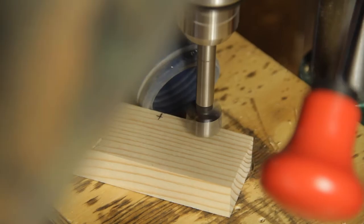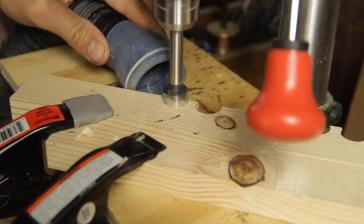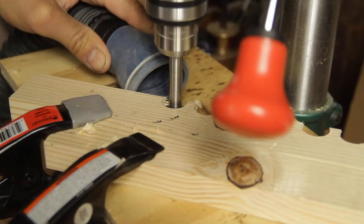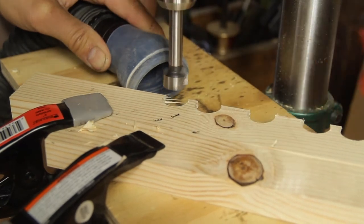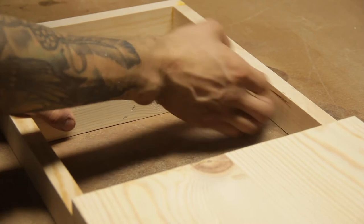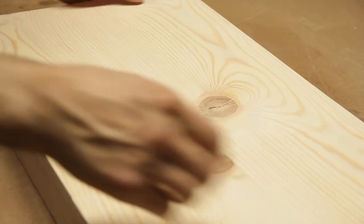While I was drilling, I realized my workpiece was still getting pushed away from the Forstner bit. So what I ended up doing was adding a backer board out of scrap wood and clamping that down — that way my workpiece had nowhere to go. Then I gave all of those half circles a nice light hand sanding just to knock down all of those sharp edges.